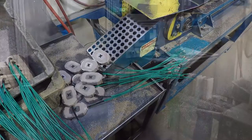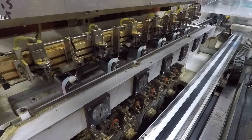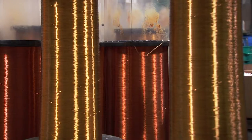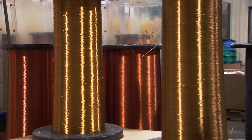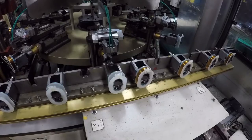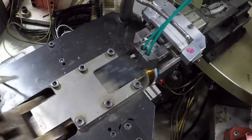Dexter magnets are another critical component manufactured in Albion. Our automated magnet winding and testing procedure is matched by no one. We verify the size and gauge of wire before automatically controlling the number of turns while winding the bobbin and attaching each wire robotically.